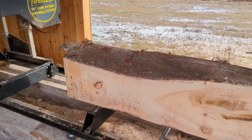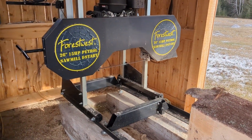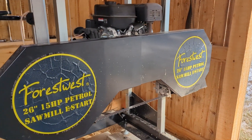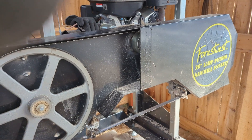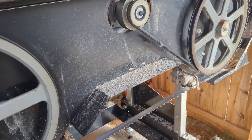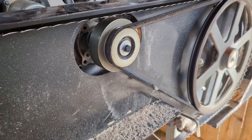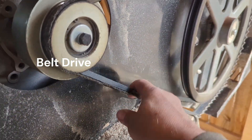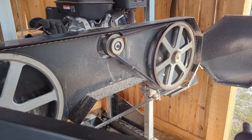Today I was cutting this pine log and I'm getting a lot of belt slippage. I thought the belt was just worn out, but it seems the pulley needs to be adjusted. To do that on this mill, we open up this cover. This sawmill runs on traction — the blade on a wheel being turned by the engine, so it's a direct drive system. The belt is quite loose and I can hear it, and it's shiny, so I know it's spinning because it's too loose.